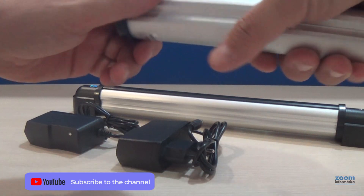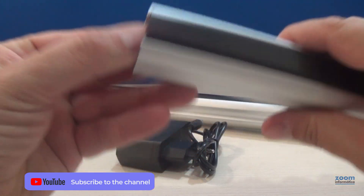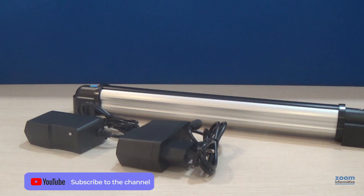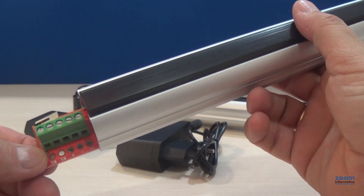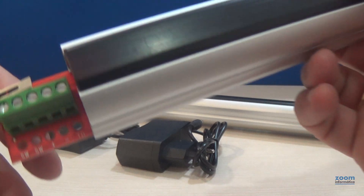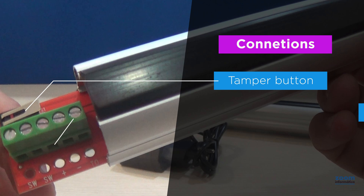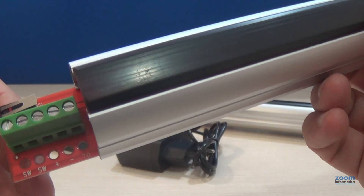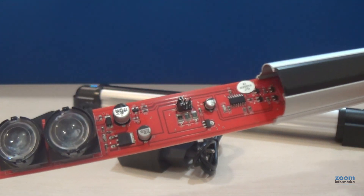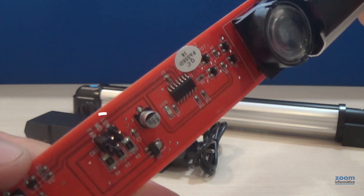Open up one beam to see the components inside. You can see the tamper button and the positive and negative 12-volt power connections to the charger. Open the rest of the detector to see other parts, like these jumpers, which will allow you to adjust the detection sensitivity.